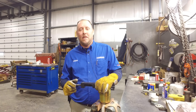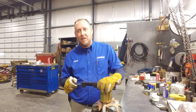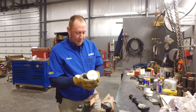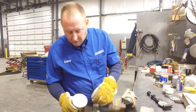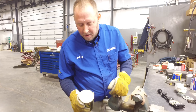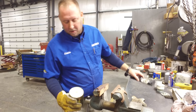So now we've got our cheaper aftermarket filter clamped into the vise. Got the filter cutter on it. We're going to cut this one open so we can compare the two filters. Inside the cheaper filter, notice how they're using a much lighter glue. Also notice that the amount of paper is different. Inside the cap there is still an O-ring, just like we had on the Kubota filter.